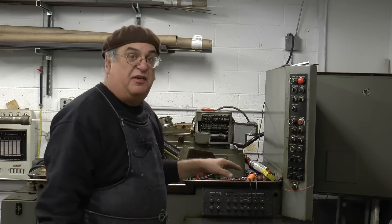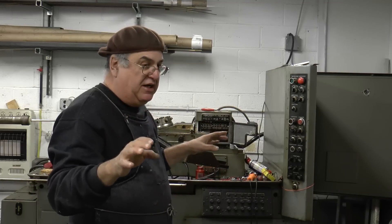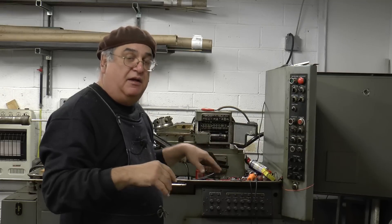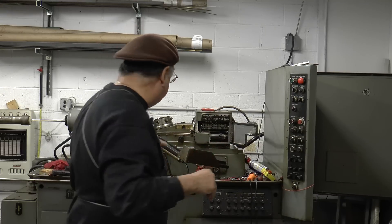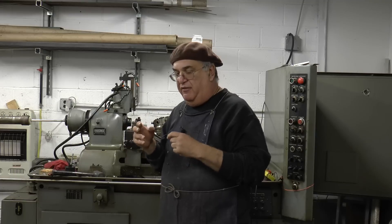I've got it shut off right now because it's pretty noisy, and we've got the air compressor up there. It doesn't use that much air, but there's a leak somewhere I need to tighten up. Once I do that, it really doesn't take that much. It's got a hydraulic collet closer, which is good — it's not running on air. Some machines run constantly on air, but this one is hydraulic and it seems to work fine.